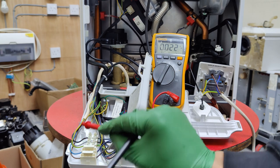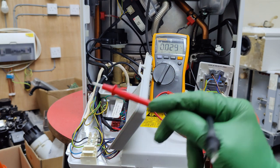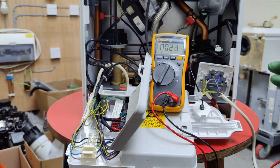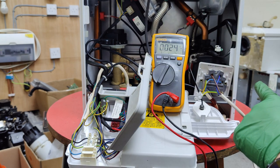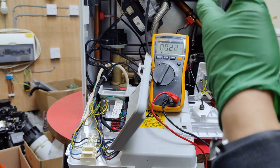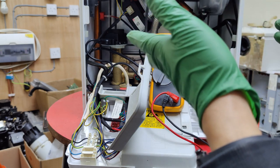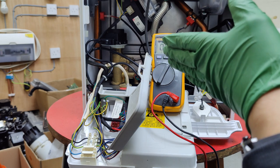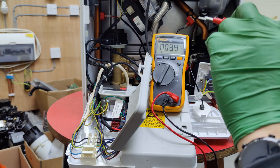The only thing feeding the circuit at this point is the cable in between, so we need to double check that the cable is not damaged, and that the termination of that cable — either on the boiler side or the fuse bar side — is not poor. Sometimes there is a breakage or disconnection in the cable itself that causes it, and sometimes poor termination simply causes that problem as well.